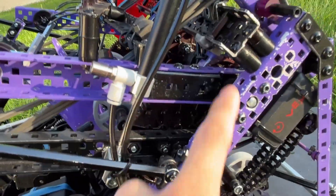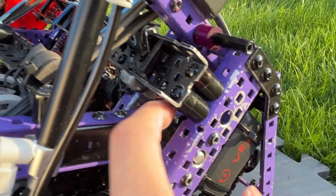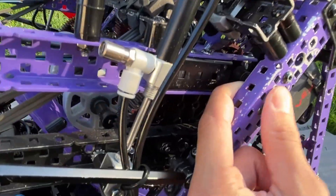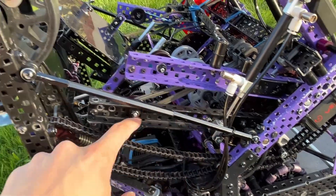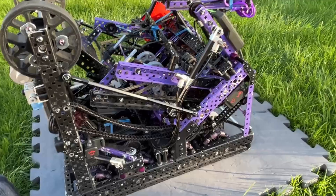The arm is braced here — this is a hard stop, and it's also boxed. You can see the arm is actually pivoting around a live joint — this is the slip gear axle. It's here and here — this is an 84-tooth gear that the arm is connected to. We have banding from this arm going to the front of the bot, and that's how it's powered.